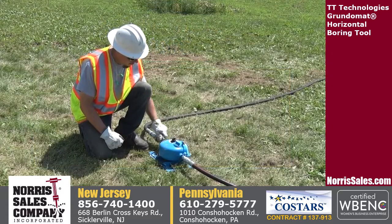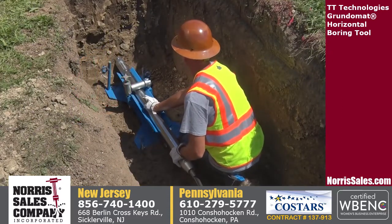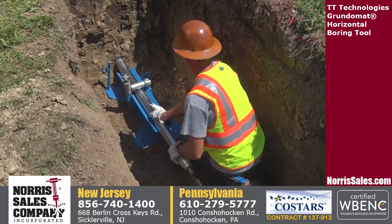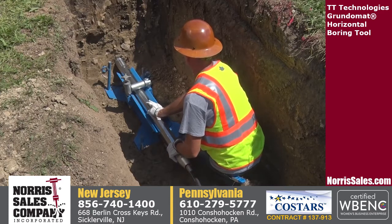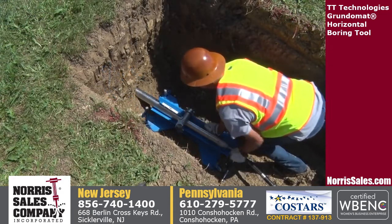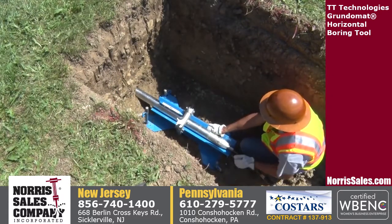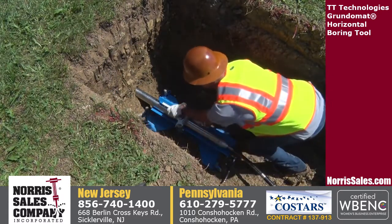Use a quick surge of air pressure to start the tool. Then throttle the tool back for boring. Once the tool has entered the soil, stop and check the alignment. Adjust if necessary and continue boring operations. The patented reciprocating step cone chisel head helps ensure maximum boring accuracy.